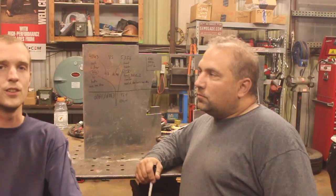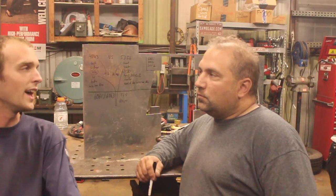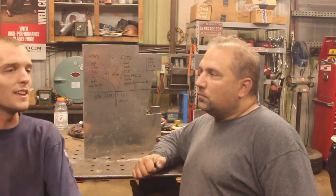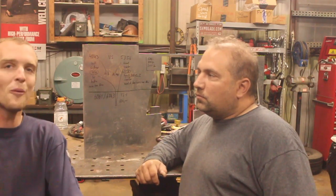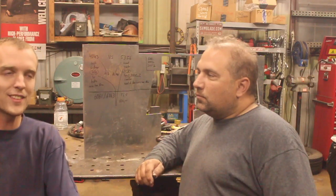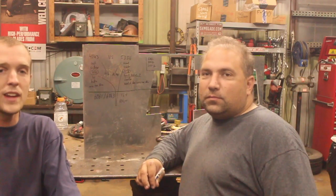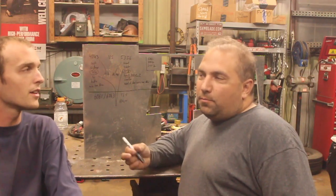There's just too much that can go wrong. With cast iron, sometimes those casting materials have whatever was thrown in before they cast it, so it really might not be the easiest thing to weld. That being said, I'm not aware of a single cast iron or cast aluminum repair I've ever done that has failed — nothing's ever come back. Doesn't necessarily mean it's never failed, but I'm not aware of any problems that have ever occurred.